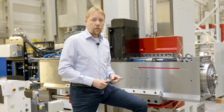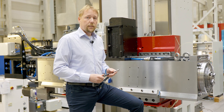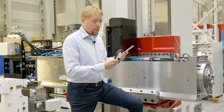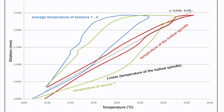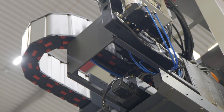Temperature compensation of a boring spindle extension is based on this small temperature sensor. It is mounted on a suitable place into the headstock, by which we get precise information about boring spindle temperature. Then, by using a special mathematical algorithm that is inside the control system, we can keep the accuracy of the boring spindle end position in the range of plus minus 15 microns.